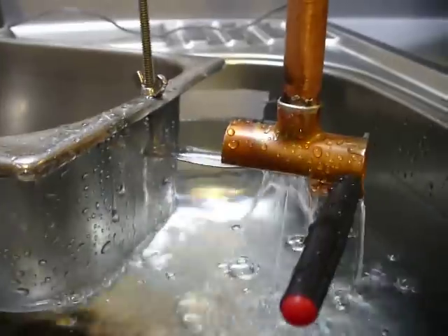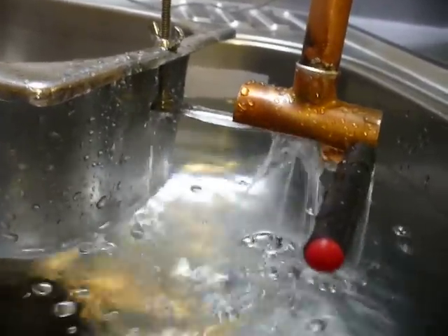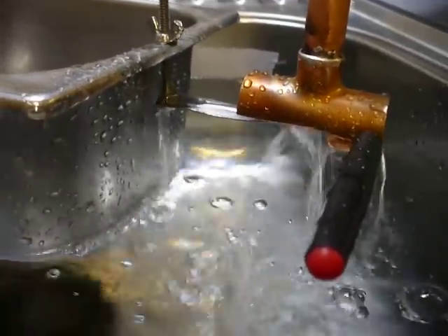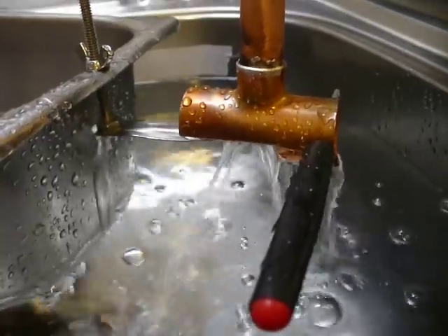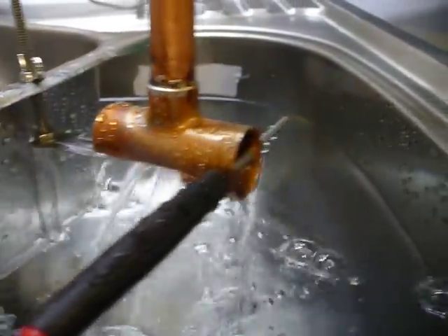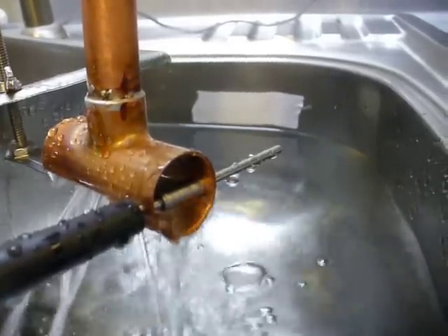And now I'm going to go ahead and add another stream to the water being taken out to simulate a faster evaporation. And you'll see the float adjust accordingly. You'll see now that it's adjusted to let a lot more water come in — more sap. All the while maintaining the level of the tape. It's slightly lower now, but you get the idea.